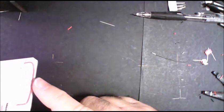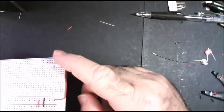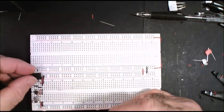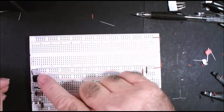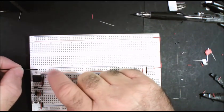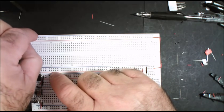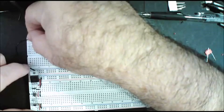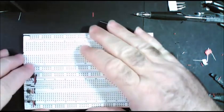You can put a dab of hot glue right on that to hold it in place — just put the dab right there and do not do a long run, because if you have to troubleshoot and you're shorting out, you just pull one of these two out. Now the tab on the voltage regulator — I'm going to jam it into this. This tab is minus — the little metal tab is a minus or the ground on the voltage regulator. Do not put the plus on that side. Now the buses are done.